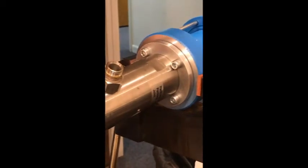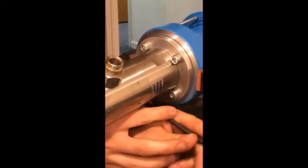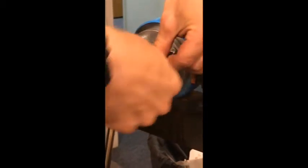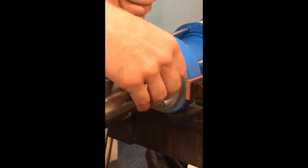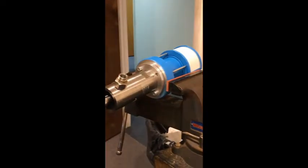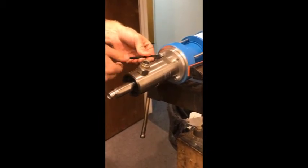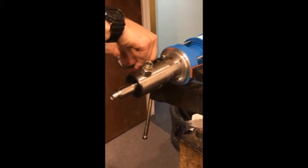If your pump already has oil in it, you're going to want to drain that ahead of time. When you remove this top, it will get a little messy, so just be aware. Your assembly will probably have its components on here — if you have a 150, you'll have your regulator on here; the 650s as well. Whatever configuration you have, this will still apply for your pump.